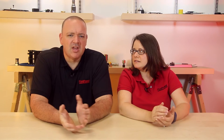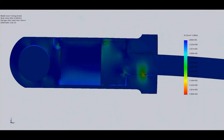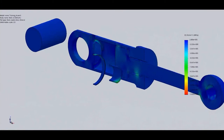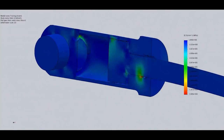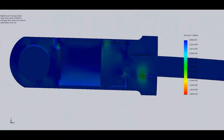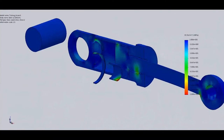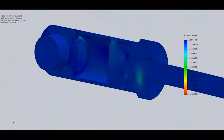So what exactly is side loading? Side loading occurs when a mass or force pushes the rod up, down, or to the side. A cylinder is happy when the in and out forces of compression and tension are applied, but any bending force causes accelerated wear at best, and a bent rod at worst. When a cylinder is retracted, it has the highest resistance to side load, not only because the torque effect is low when the rod extends a little past the rod bushing, but because the other end of the rod is supported by the piston deep inside the cylinder bore. As the cylinder extends, the moment arm extends as well, increasing the torque potential on the rod, as well as moving the piston closer to the head. This reduces the capacity for the piston to act as a bearing. Side loading also causes uneven wear, as the rod pushes on one side of the bushing, and the piston drags with more force across one side of the barrel.